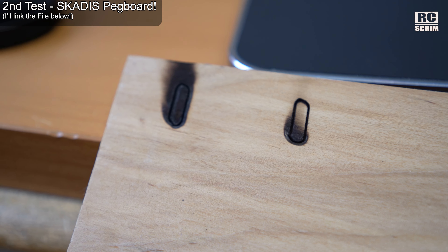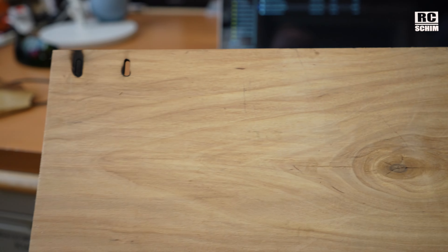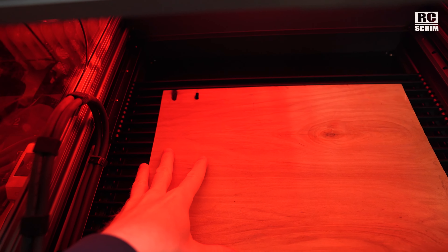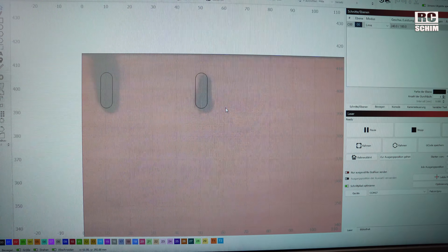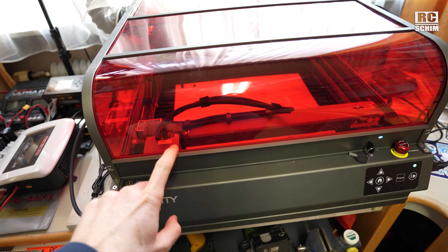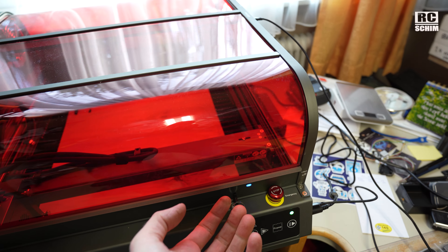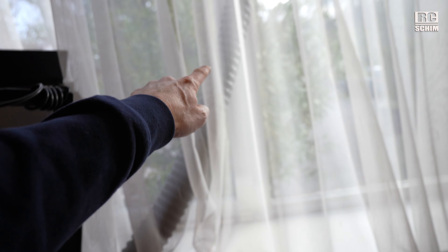My idea now is to cut this backboard. First of all, I forgot the air. Now I will have to align these two holes with the remaining holes — not too hard with a good calibrated cam. Right five millimeters and down two or so. Now you hit ALT and C. You can zoom in quite a lot. 230, full power. And I am excited to press. Once you close the protective cover lid, the magnet here will give the computer a go. If not, the light is out — it's a little safety feature. There's also a key, so you can use the key to restrict access when you want to, not your kids or something. The fan blows the fume out of the window. It's not ideal, but it keeps the ugly smell out. There is the air pump.